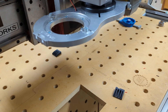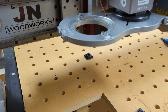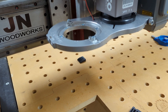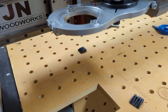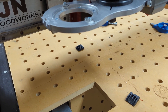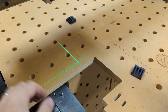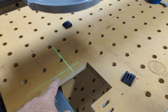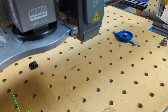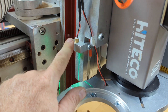I added this one because the new coming EX control system that Avid is bringing out actually supports a crosshair. They've got basically an offset function where you can line up the crosshair and program a static offset value into the CNC12 software from Centroid. You can set an X and Y offset so I can turn this generator on, align this crosshair up with any point, and it will offset that to my spindle — or anything else I want, like a laser or other tools. I put it back here out of the way; I'll put a link in the description for the generator I used.